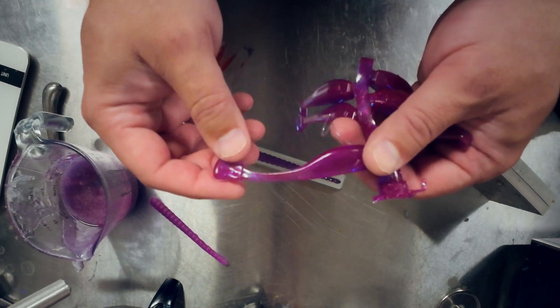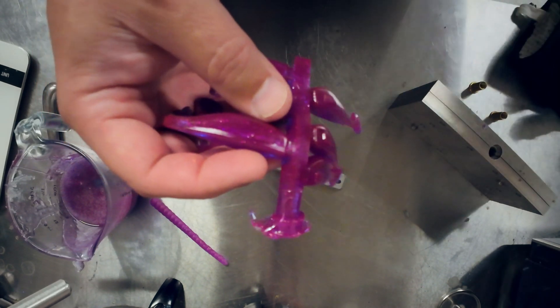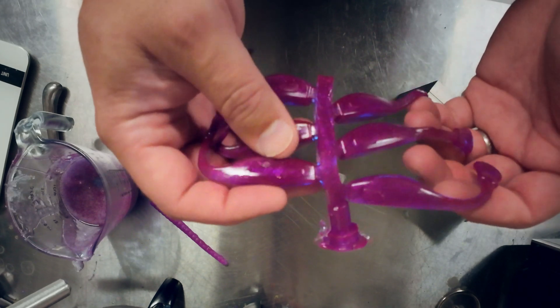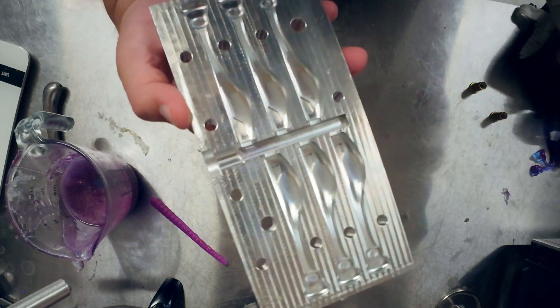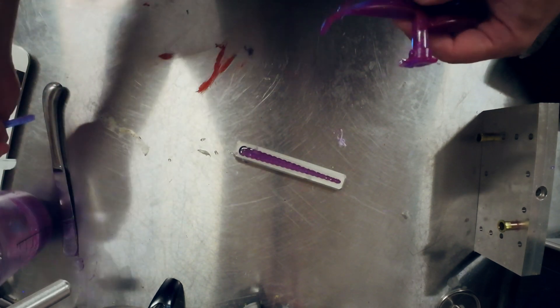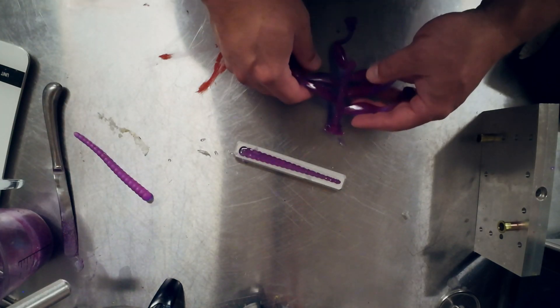This color is ridiculously cool - I'll have a video on the recipe shortly so hit subscribe. You can see this Protolabs mold is relatively shiny - not as shiny as you'd get from someone who really knew what they were doing. I sent it to Protolabs and just said leave tool marks, so it is what it is. It still produces a shiny bait; you can see these very small lines inside the mold cavity. The first pour out of the 3D printed mold shows a pebbled finish - which I think is certainly unique and pretty cool.